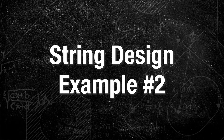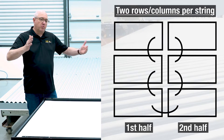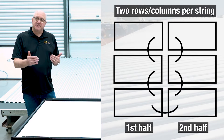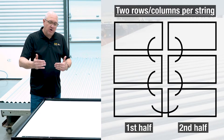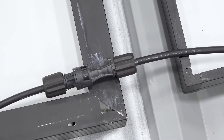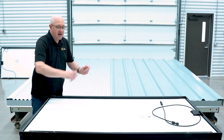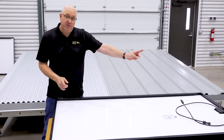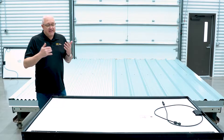The next building block we're going to talk about is the case where your column or row length is exactly half of the string length. In that case, you can go down and back with two columns or two rows so that at the end your string ends are there naturally, and all you have to do at the bottom is connect two across. The one thing that's a little difficult when sequencing modules is they're not all alike: the ones at the top have conductors at the side, but at the corner, one conductor's on the side and the other is 90 degrees pointing outward to connect to the side of the next one to create that loop.